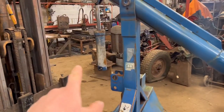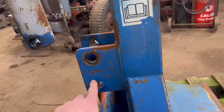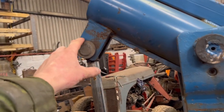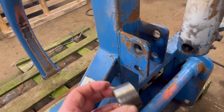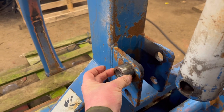There's a ram on the back here that opens the jaw up, but the problem is these holes are worn oval where the ram goes in — those holes are oval as well. So the whole lot's slopping about. The simple fix is I've just made some bushes, I'm going to weld them on either side and put a longer pin in. That'll sort that job out.